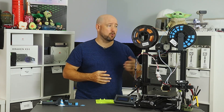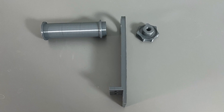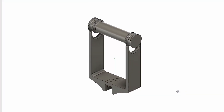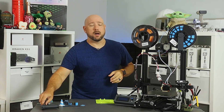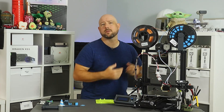I also had to design a spool holder for the second roll of filament. My first design mimicked the existing spool holder, however the single arm solution was kind of wobbly, so it was replaced with a far more sturdy dual arm design. Finally, since we now have two spools and two motors sitting atop the printer, I added some aluminum 2040 corners to help stiffen everything up a little bit.